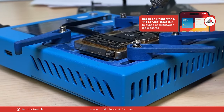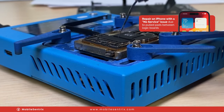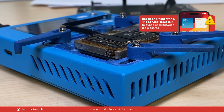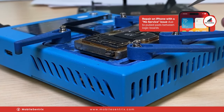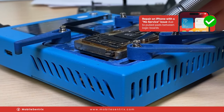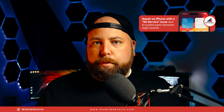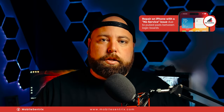In the previous video we went over how to simply reflow a board using a board heater to correct this issue. A lot of the time with a hard impact — something that breaks the screen, the backlight, or the frame — the newer iPhones have a tendency to somewhat split the top from the bottom board, therefore losing cellular, Wi-Fi, and Bluetooth. A good portion of the time the solution is simply to heat up the board and let the solder joints reform.